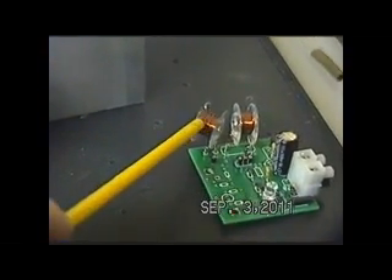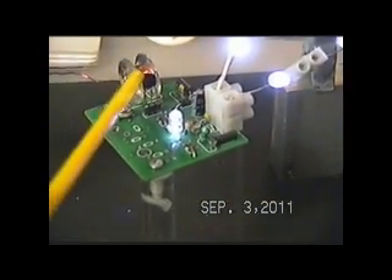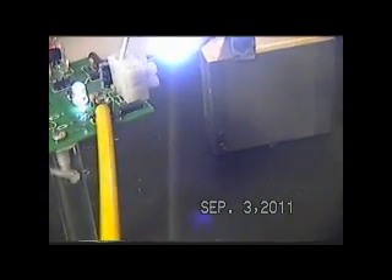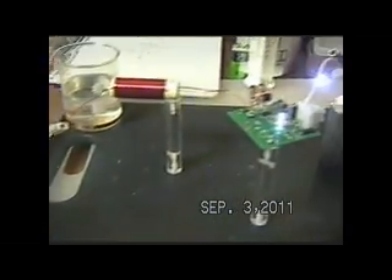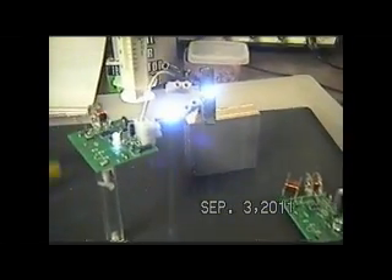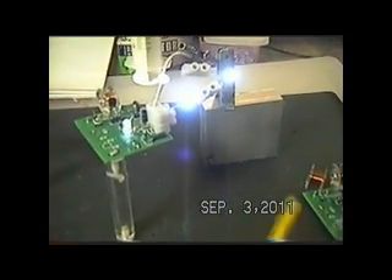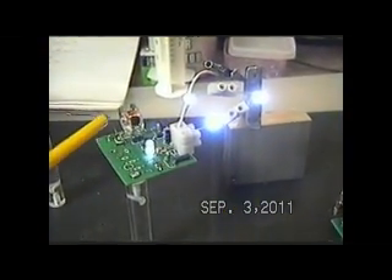What I'm going to do next is take and wind the added inductance that was added by this bobbin — to bring it into range — onto a new L3, so that I can have just the one bobbin as exists here and still have the tuning capacitor removed, or else I may add one with a larger range. But you're going to have to have the test equipment to find out if you really have the natural group present, what its intensity is, and you're going to have to be able to watch the effects on the board via a spectrum analyzer so you can see the harmonics appear as you start tuning this whole system into that natural group frequency range.